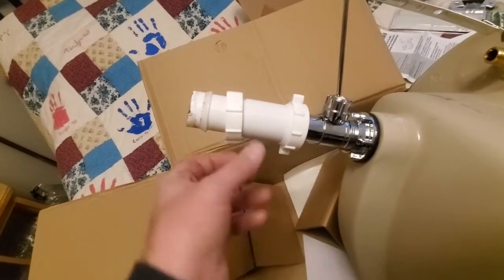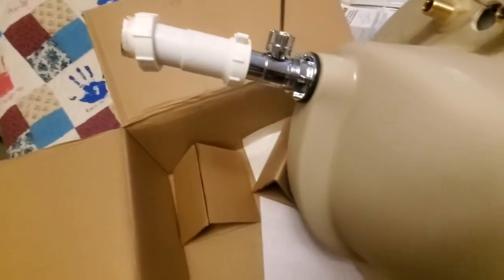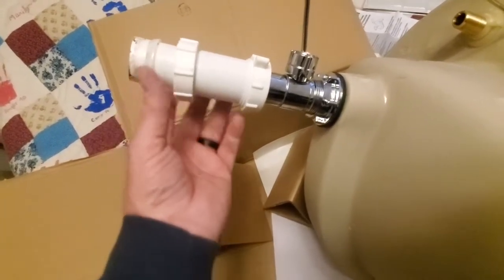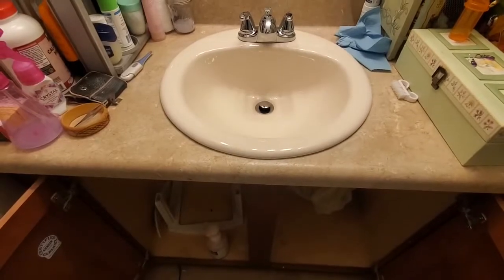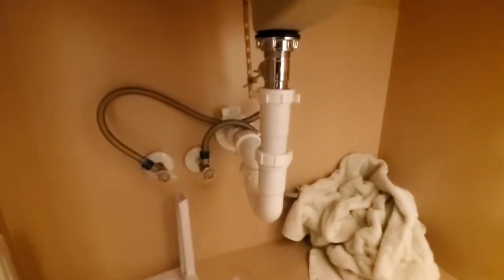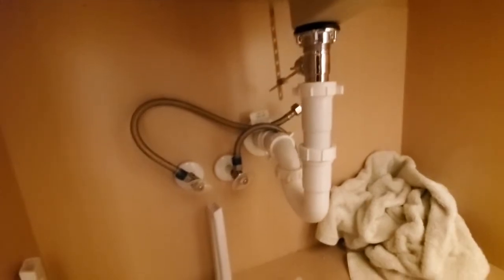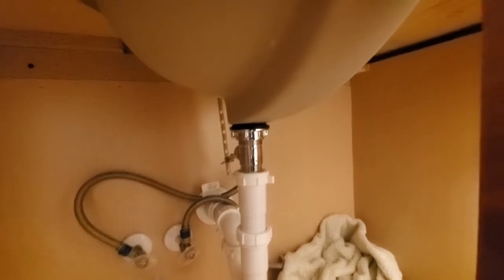I put the intermediate piece of pipe on there and when we drop it in it will connect to the trap — right now it's loose so I can move the seal as needed. There's my final test fit — drain lines up, water lines fit, so I don't need to replace water lines for a different size. Looks like we're good. Just need to add the sealant where you can see light coming through, drop it in for final, let it cure, and then tighten everything down.